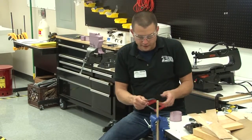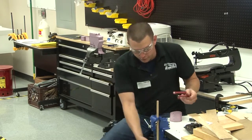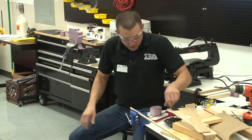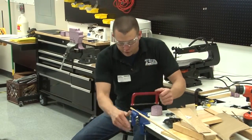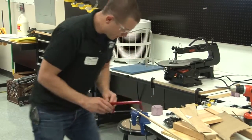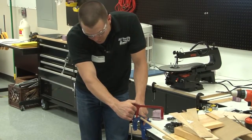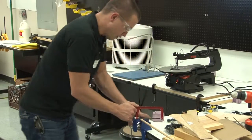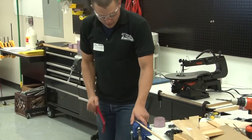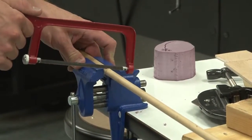make the cut from the side here. But wherever I'm going to do it, whether like that, or pulling it up this way and doing it here, you would always want to do the cutting as close to the vise itself as possible. This can work. I'm not going to do this sitting down. I'd be standing up, mark the material, place the saw blade onto a spot, and make a slow pull, a slow pull for that first one, just so I get a groove there. And then I could start to saw a little bit faster. Use the whole blade.